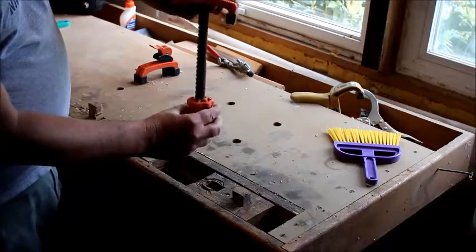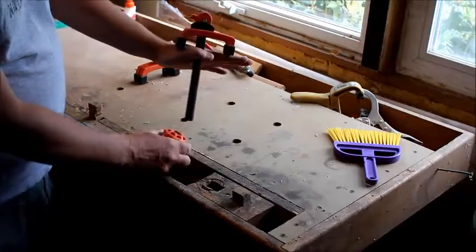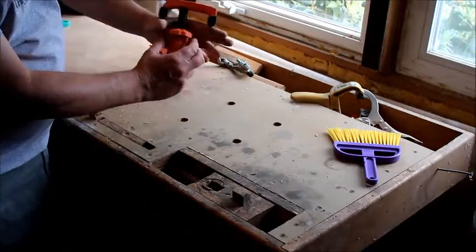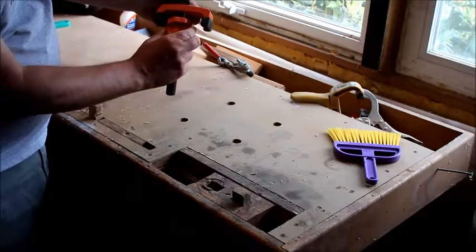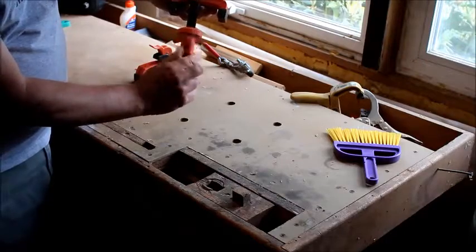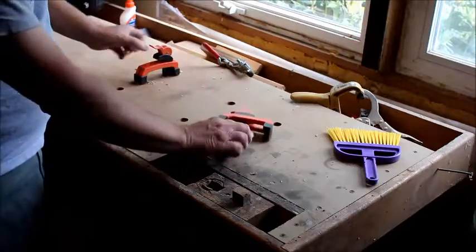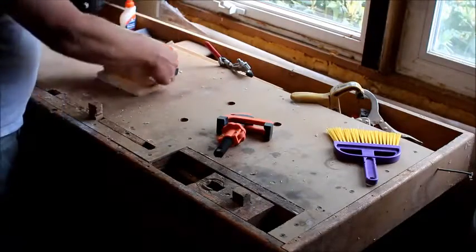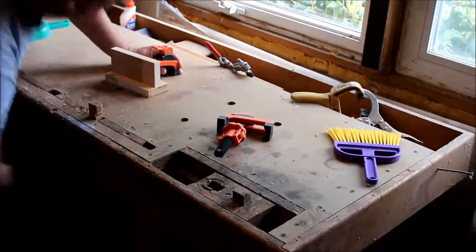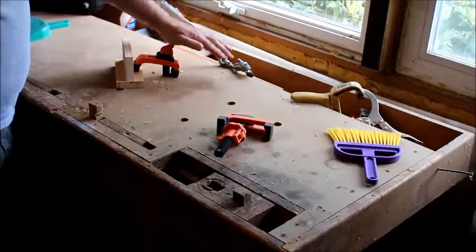So if you're on the bench, like my hand here, you can reach underneath and squeeze these ears, and this slides right up, so it kind of bypasses, and then the threads engage when you release them. So now you can tune and get this thing squeezed up. The way it works is you put something underneath it, and then snug it from the bottom, but then use the clamping action here to really hold it down.